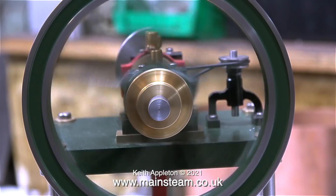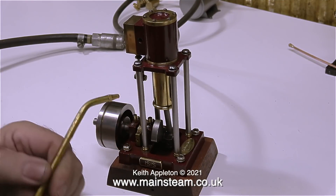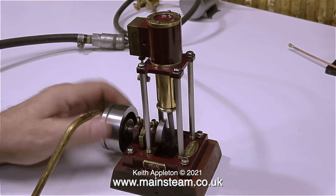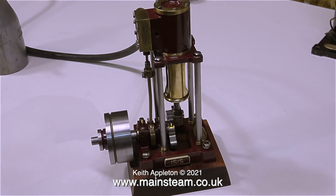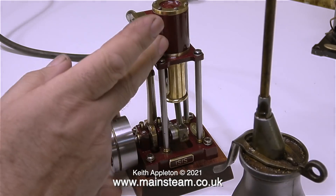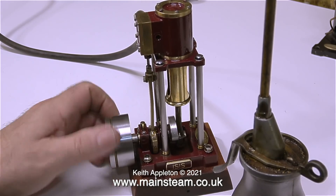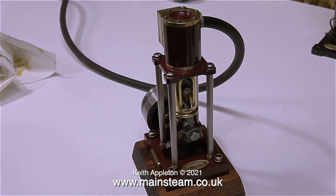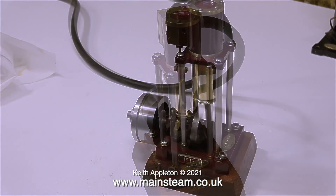This is the centrepiece of the steam plant, and now the one to the left. This is also a vertical type steam engine but it's quite a lot smaller than the aerial. Time to see how this one runs. Well it's very wheezy, I'm not sure what's going on here. I'll pump some more oil into it — I'm pumping oil into the exhaust port because you can do that, but you do need to rotate the engine in reverse to suck the oil into the steam chest. Despite having plenty of oil in the steam chest and the cylinder, the engine is still a bit off, so I'll just listen to it.